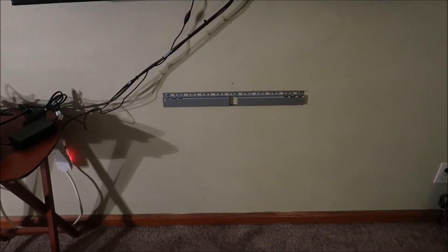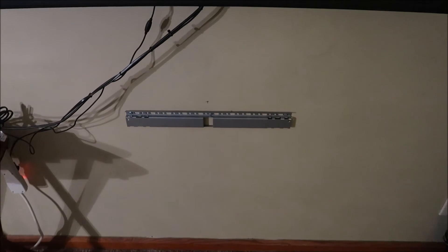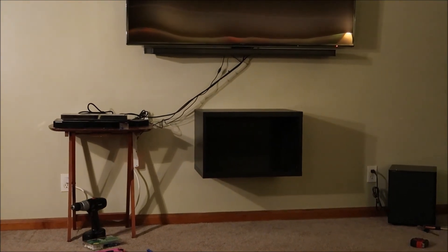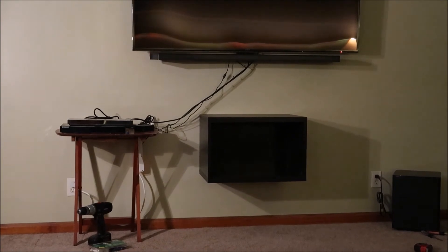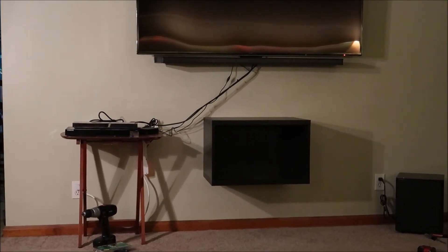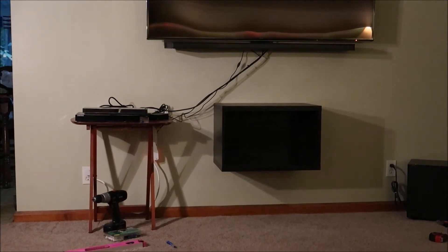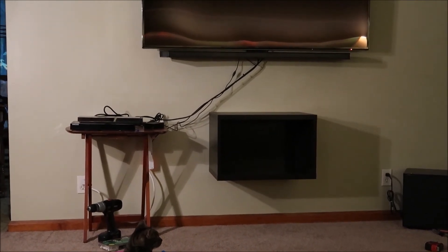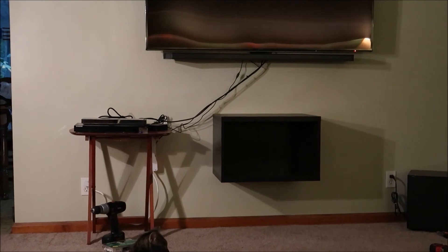So the bracket is up with a couple of drywall screws. I did get lucky and hit a stud right here, so two drywall anchors and screws and then right into the stud. Shelf hangs on top of that. So the next clip you see will be a shelf in place. There it is — shelf in place, hanging on the wall, a little over a foot down from the TV. Now it will be three times as big, going across the entire TV. We'll be able to put stuff on it and keep stuff in it. To do the next part is actually a double of this, so it gets big and is even more difficult to hang. I need Kristen here to help me drill all the holes so everything lines up perfectly straight. So this is where I'm going to end it today with this shelf.